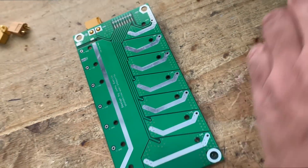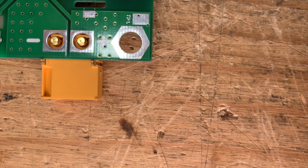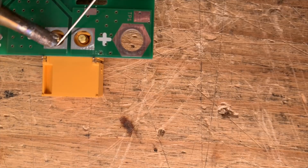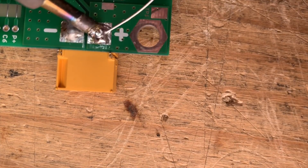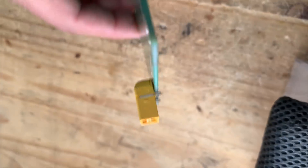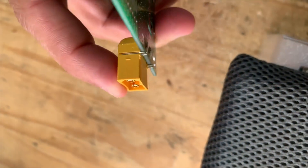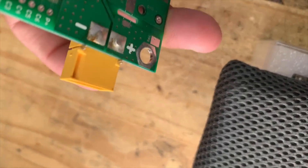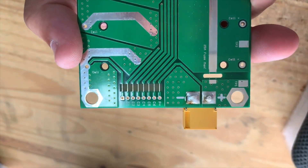At the back we'll just have to use a lot of solder to fill those up — how much, I don't know, let me test it. There we go, now we have a 90-degree connector. It's pretty strong. It'll be better if it had the proper holes, which we will have on the future version of the board, but for right now this works — you could totally do that.